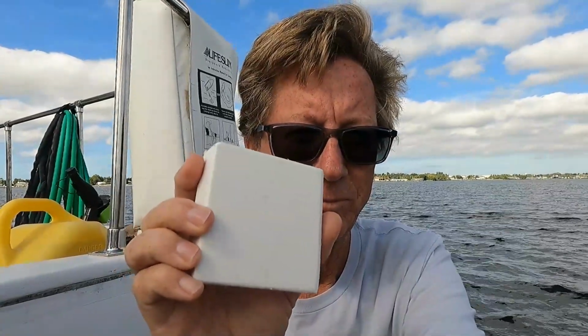Regardless of whether your boat requires it or not, it's recommended that you use a spacer block between the transom of your boat and the transducer. I'll explain why later. You can use whatever material you want for the spacer block, but I've chosen to use starboard. It's water impervious, so it's not going to rot over time like wood. But you can use whatever you want. Just if you use wood, know that you're going to have to keep it painted to keep it protected. Where starboard, once you put it on, you can forget about it.